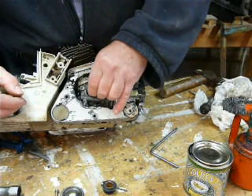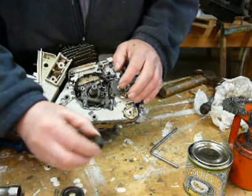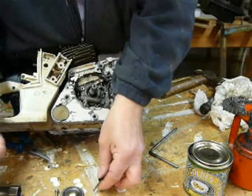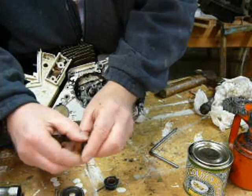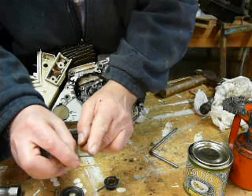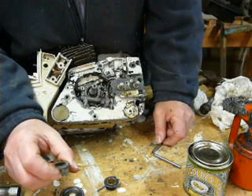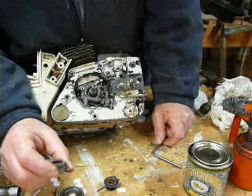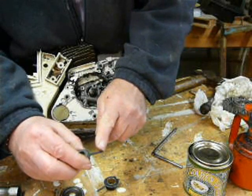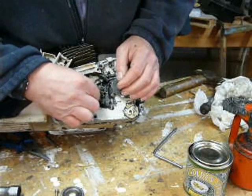Pop the washer on, then the seal bush. Now this has got a new drive quill — here's the one I took out. The quills are separate from the worm drive so they're a replaceable item. This one is really worn on the end. So if you have one of these saws and the bar oil hole is clear and you've got oil in the tank but it still doesn't oil, then the next thing to do is check this, because they do break at the end and wear out. They're quickly replaceable and then your pump will be running again.